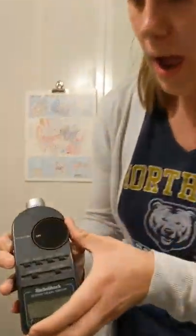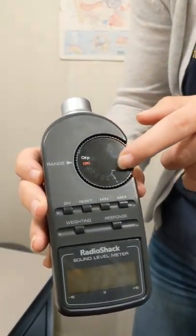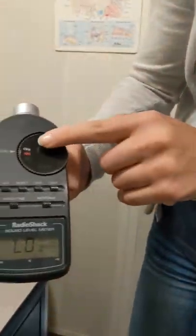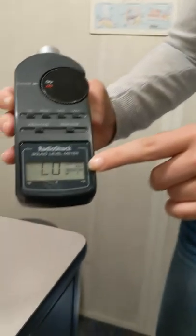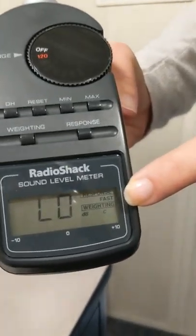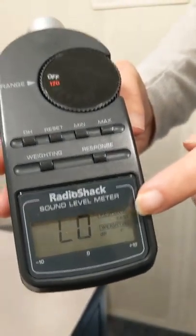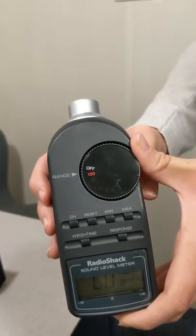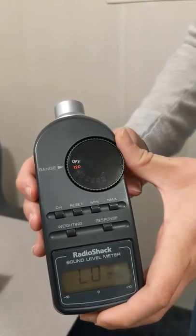Hi and welcome back. We are going to calibrate the speakers. We have our handy dandy sound level meter, and first we have to turn it on. There are lots of different numbers — it ranges from 120 to 60. But if we have the range set at 120, the level I am speaking at is too low and it will not correctly read it. So we want to set it at 60 dBA on fast response.